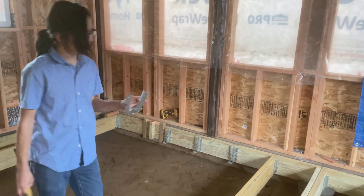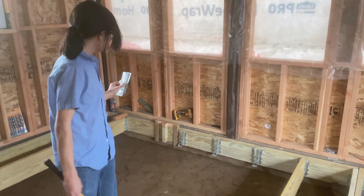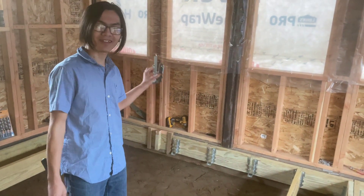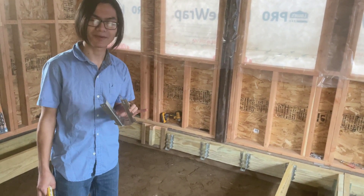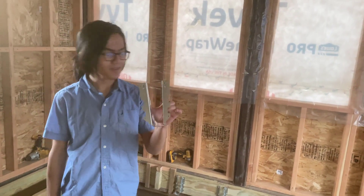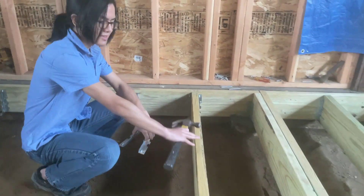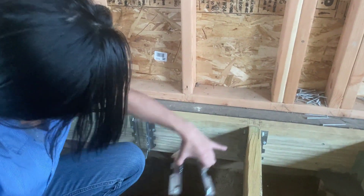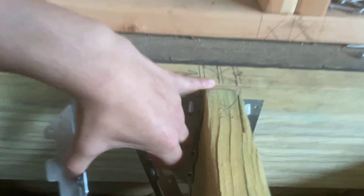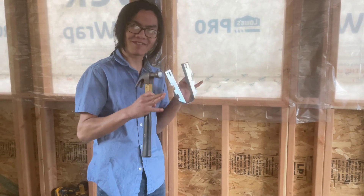In our case, this is actually our last chance to talk about joist hangers because after we have this last one up, there won't be another opportunity. So, we want to make sure that our joists are flush with the top of our beams. As you can see here, they're not quite flush, and the idea is to find a way to achieve that flushness.